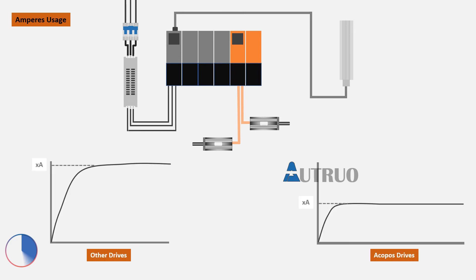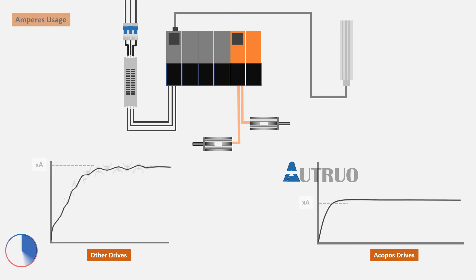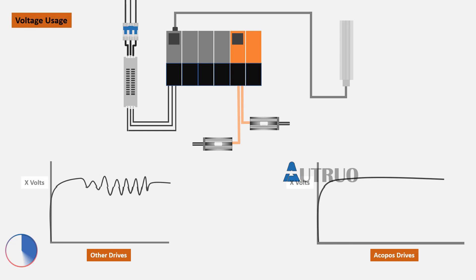Stable Voltage Conditions: Even if there is fluctuation at the input of the power module — that is, when the line filter fails — the DC bus voltage will remain constant regardless of the mains supply voltage. Hence, maximum utilization will be achieved from both the inverter modules and the connected motors.